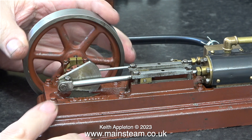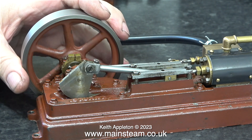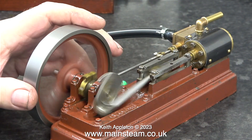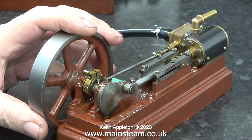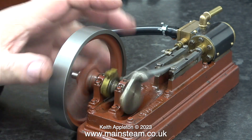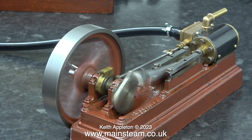Here I'm looking at the timing, and everything is absolutely spot on. The admission of the compressed air is not early and it's not late — it's perfect. And even though I haven't put a silicone O-ring piston in this engine, it still runs very well. When I grip the flywheel, I can feel how powerful it is, and everything is 100% on this. Just listen to it in slow motion.